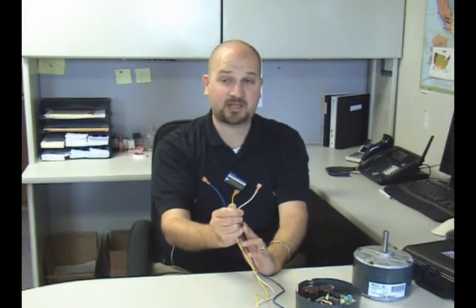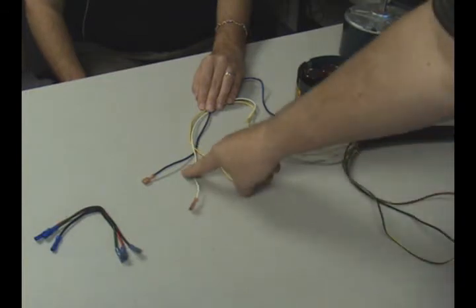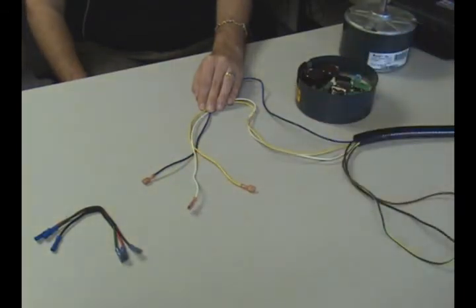Before you unplug any connection, make a note of it so that you can reconnect the leads properly when finished. Note that if the blue, white, yellow color scheme is used, the blue wire is typically tied to the common side of 24 volt incoming power. After disconnecting all power — 240 volt and 24 volts — into the system, disconnect the signal wires one at a time from the circuit board and plug them into the appropriate quick disconnect male terminals on the red-yellow adapter set. You will have to temporarily remove the safety cap terminals covering the male tabs — keep them handy and reinstall them when finished. Make certain any unused terminal is completely covered to prevent accidental shorts.